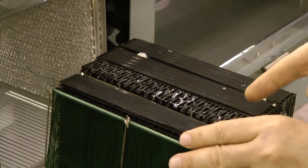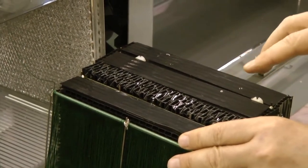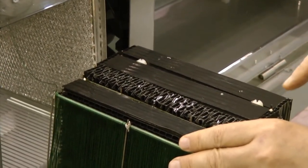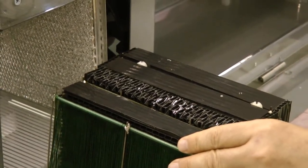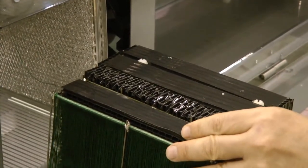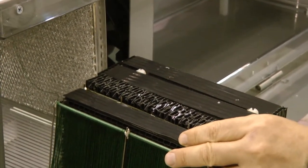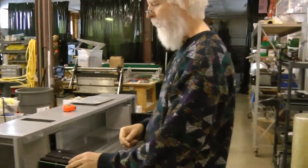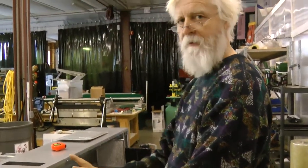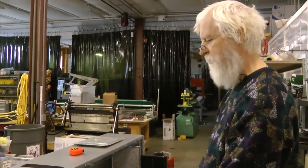We use that to control the power going to this heater, and we extremely carefully measure the amount of power going into this heater. So now we know the exact temperature rise before and after the heater and the exact amount of power — meaning we know how many watts it takes to raise the air temperature by around one degree. That's happening all the time, live while it's running.